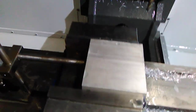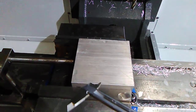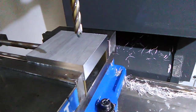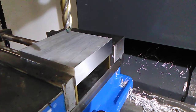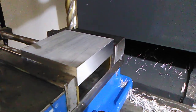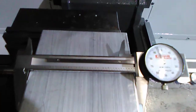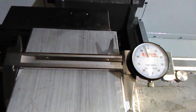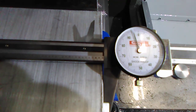So just turn the stock, like I said, from here to here, and we're going to cut these edges off. Trim them. Alright, took off 10 thousandths, one shot, one pass, so that's good. Hopefully I didn't take off too much, because I still got to take off the other side. Because the other side is still stock. Let's do that. Okay, when I went 10 thousandths, I took off too much on this side. I am under 5 thousandths, but I am good.